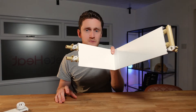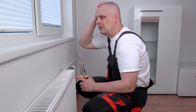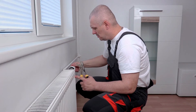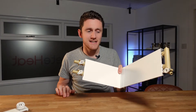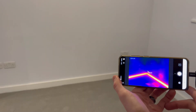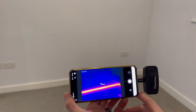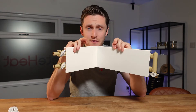Many people think that skirting heating is going to be wildly different from radiators, when in actual fact it is just one big long stretched-out radiator. Where your pipework branches off, water flows into the radiator and back out again. That water transfers its heat energy into the metal, the metal gets hot, and that radiates heat onto the air which convects around the room. The difference with skirting heating is that it's aluminium, and because aluminium has a very high emissivity of heat, it radiates heat directly into the room through infrared.